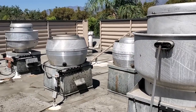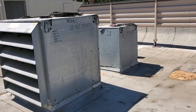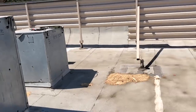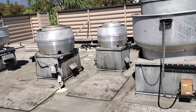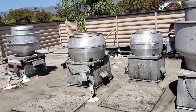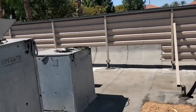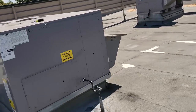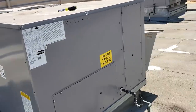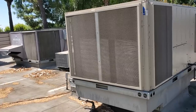They had a company come in here a couple of years back and slow down all their exhaust fans and turn off their makeup air units — that's why it says 'do not operate.' I'm not going to change that; it's an engineered thing. So exhaust fan belts are tight and they're pulling as much air as they can. Makeup air units are not running, so our makeup air comes from the ACs. This economizer and the new AC's economizer are the only economizers that are working.